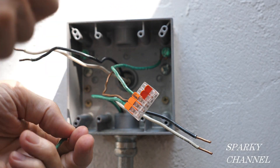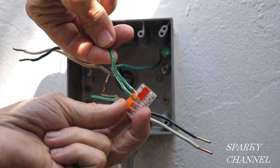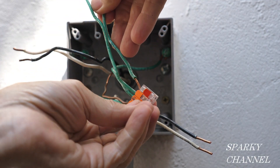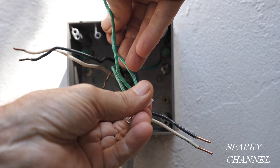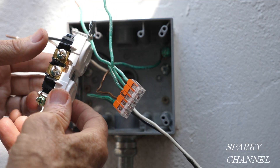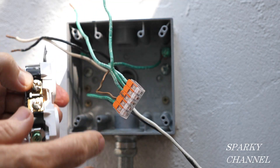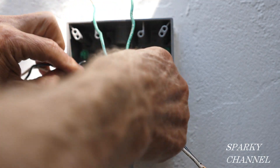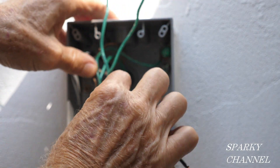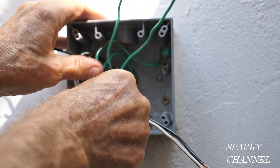I've prepared two pigtails, one of which will go to each of the devices. I put one in and click it down, then push the second one in and click it down. I'm going to be installing the devices so that the ground wires are at the bottom, so I'll start by going upward and then down with the connector, coming out here and here with the ground wires.